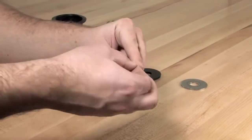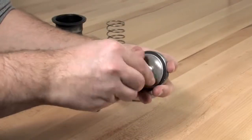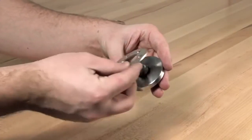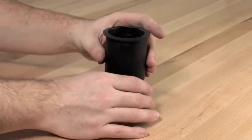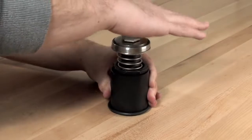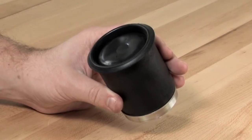To reassemble the relief valve, start by rebuilding the piston diaphragm assembly as shown. With the unit rebuilt, replace the sleeve with the ribbed edge facing upwards. While still grasping the sleeve, fold the top of the diaphragm over the ribbed edge to hold it into place. To properly refold the diaphragm, cup your hand slightly and force the sleeve down over the piston assembly with a rapid slap as demonstrated. If done correctly, the trapped air in the diaphragm will force the rubber between the inside of the sleeve and the outside of the piston. If the assembly is wrinkled, repeat the previous procedure.